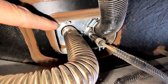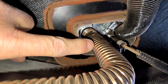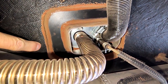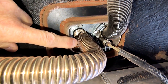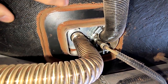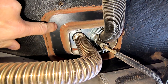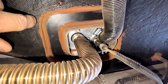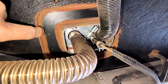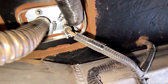I picked up this shroud on Amazon — it's just a heat shroud to help protect the decking from the heat from the exhaust, and it does a real good job at that. I over-cut the opening for safety to keep the wood back away from the exhaust. I laid in a metal plate over the top of that, then ran a bead of high temperature silicone, set this plate down onto it, screwed it to the decking, mounted the heater to this, and then sealed up the outside with more high temperature silicone sealant.